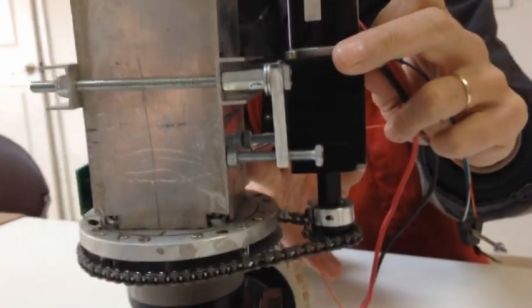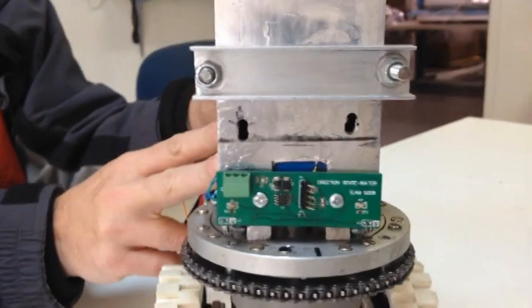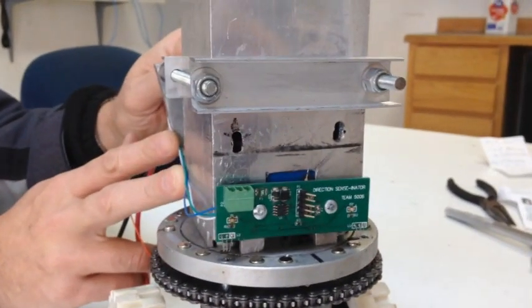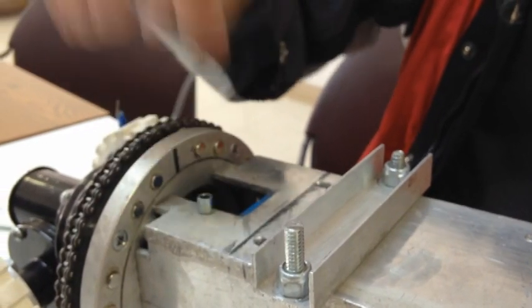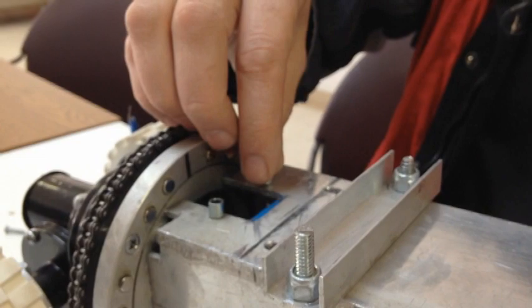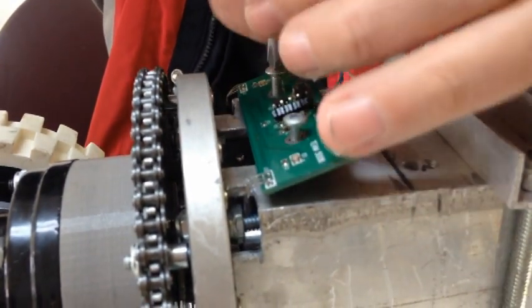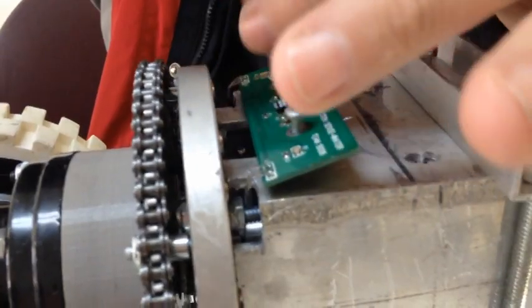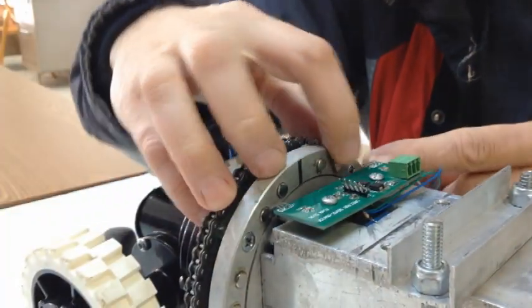You can design and make your own Hall Effect sensor board to read the magnets and location, or you can just buy the kit for our Direction Sensinator board. If you decide to do the latter, here's how we mount it. Use two 8-32 spacers to keep the board off the aluminum housing and tighten with two small screws. We threaded the holes in the tube to make this easier. Then adjust the Hall Effect sensors to be centered over their magnets.